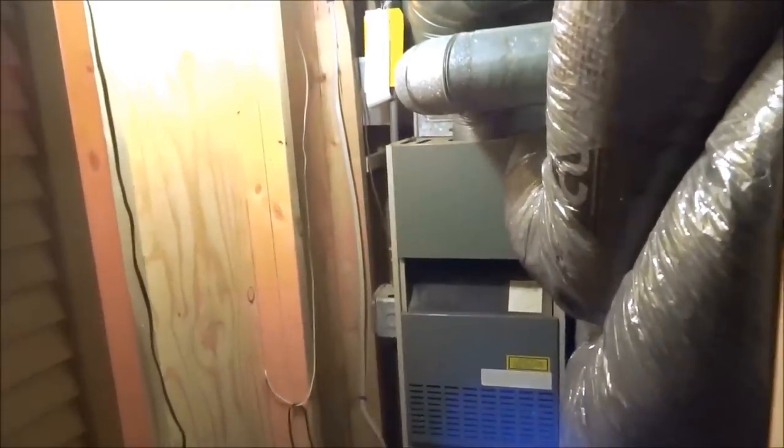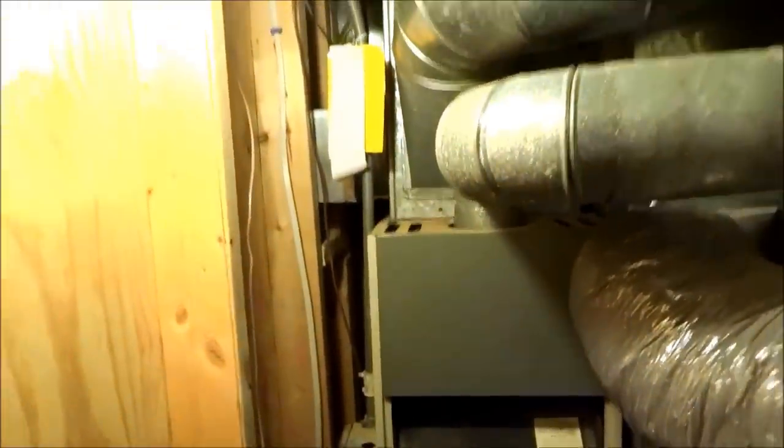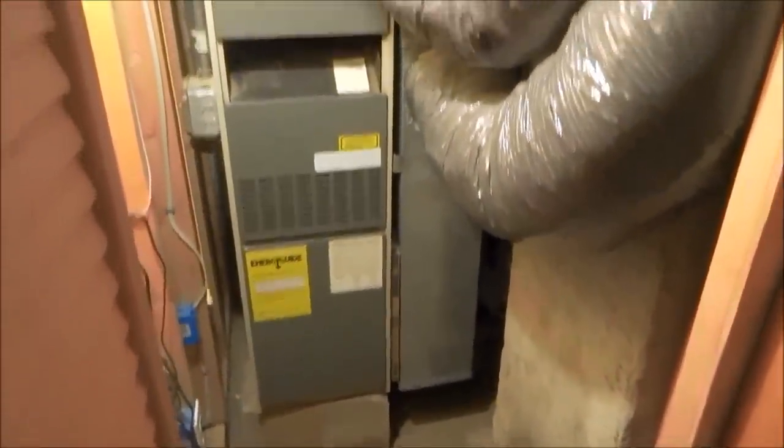This is all open down here and I'm going to have to take this wall out to be able to get to the electrical. These doors always stay open for makeup air down in the basement. It's probably going to be a tricky one. I'm going to have to cut the front of this plenum out with my grinder to get in there and cut the bolts to slide this thing out.